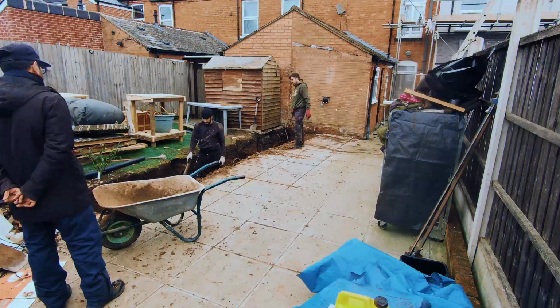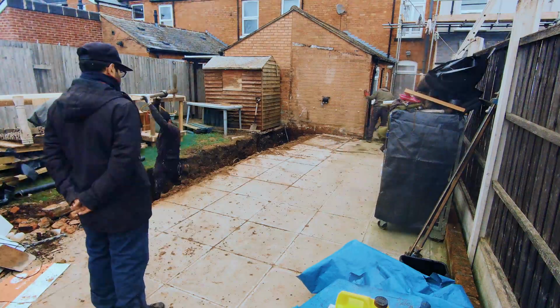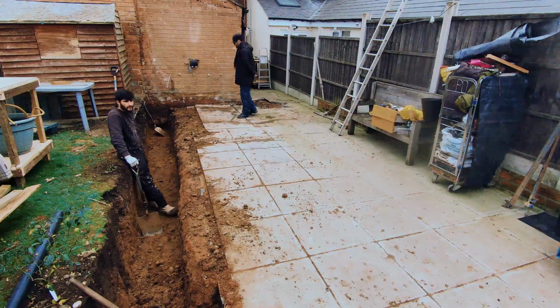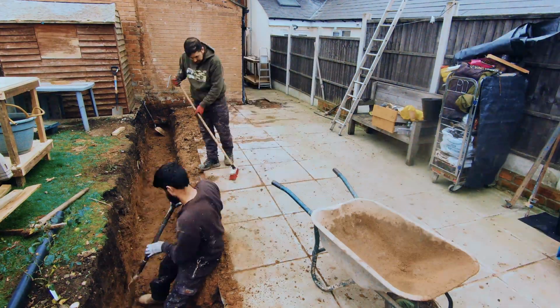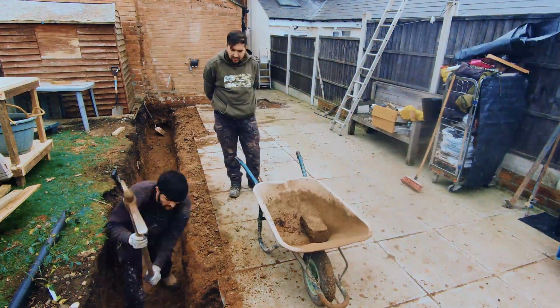Basically a couple of layers of damp proofing, and also additional midsection, like the lower floor being damp proofed as well. You'll see here in the further corner away, they're starting to take the corner of the wall out, which would be the far side, and that actually links into our existing wall to make the best use of the space.